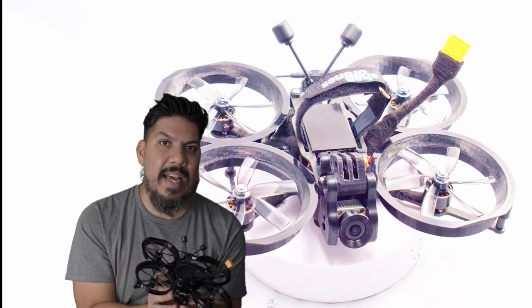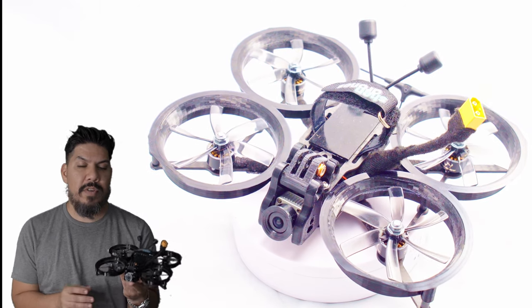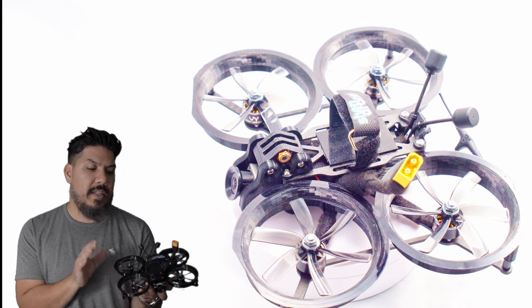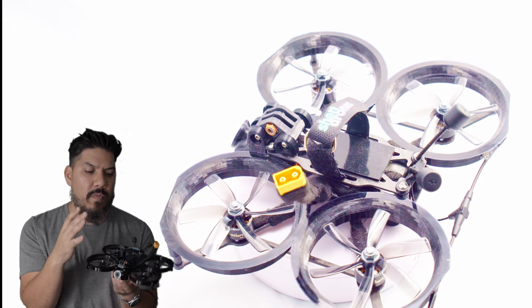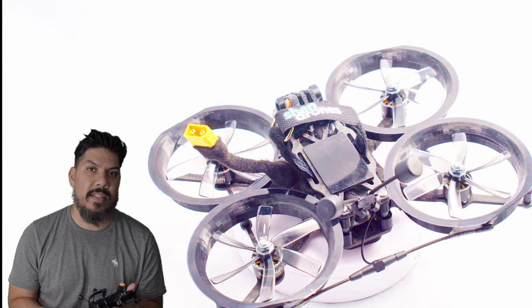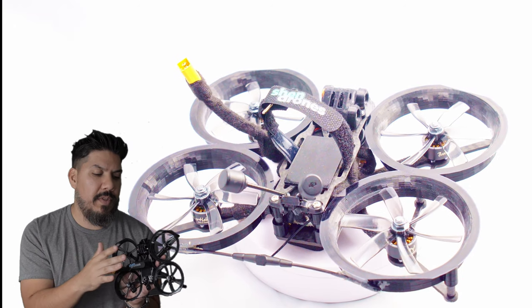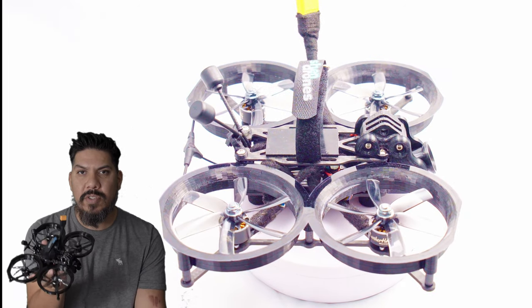Now, let's go over the build. Talon Gigawatt stack. This uses Brother Hobby 1507 3100 kV motors. That is a motor that you can run on 6S. So on this 3-inch with the ducts, you can put a full-size 6S battery because the top plate is just wide enough, and you have enough room up front for a full-size GoPro. I ran this on the GoPro Hero 9. As it is, with these six blade props, with the strap, with everything, with the full-size DJI air unit on board, it's coming in at 318 grams.